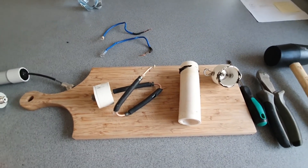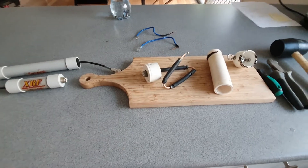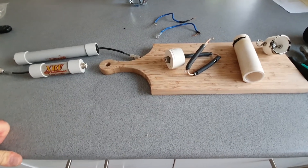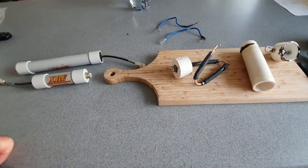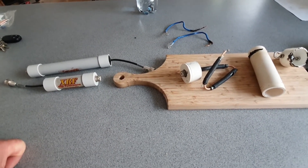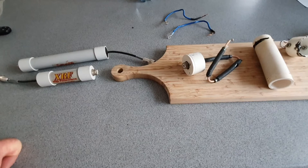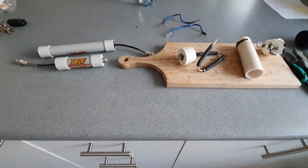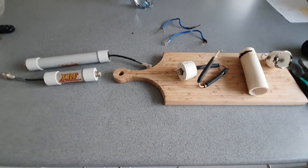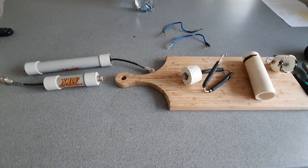Hope you enjoyed. Always investigate — the antenna is working really happily now. It's funny how sometimes you start at the wrong end of the analysis. Dropping the antenna, replacing it, and putting in a proper transformer-matched balun has totally changed the performance of the station. Thank you very much, hope you're all well. This is a great hobby and experimenting and exploring is a good thing when you're presented with the challenges we have these days. 73s.